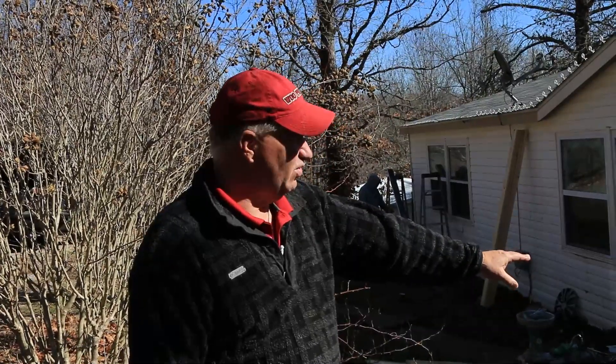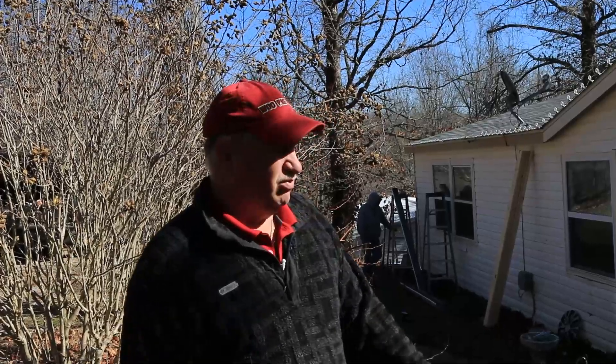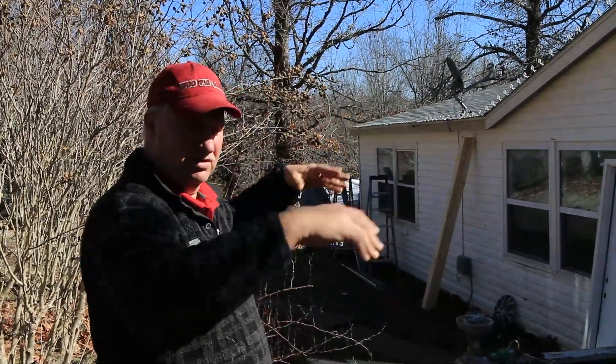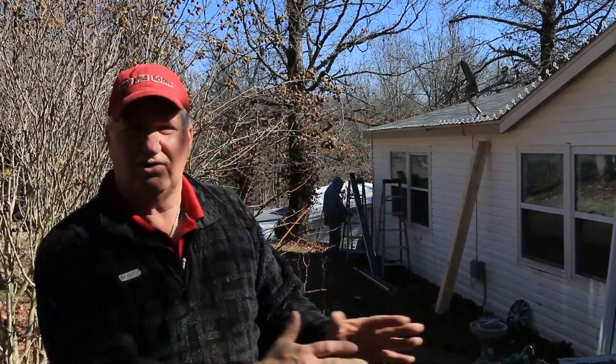We're trying to come up with a way to save this place. Now we're having damage on the door too. So the first thing we're going to do is put gutters up, and then I'll discuss with you how you can change the hillside to favor your water running away. We're going to put these gutters up on the flat areas and run it to the corners. The whole idea is to get all the water running to the corners, not to the house.